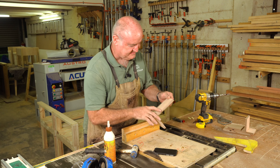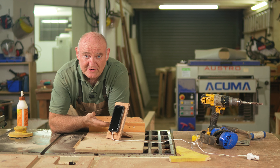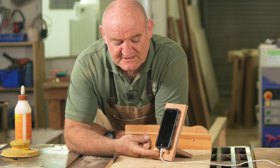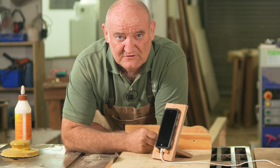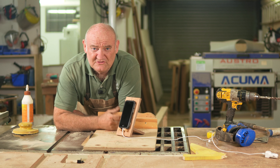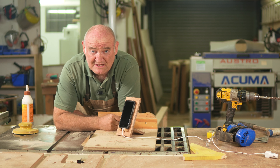We have our two dowel components. Our dowels are ready to assemble — what could be more simple? Let's get our dowels put in. We don't need a lot of glue; it's a nice tight fit. We're just going to put a tiny bit of gorilla glue in the hole and tap that home with the mallet. Nothing could be more simple. Now we simply put our kicker in the back — we already know it fits perfectly — and there it is, a perfectly good cell phone stand. All we have to do now is a little cleanup and sanding.